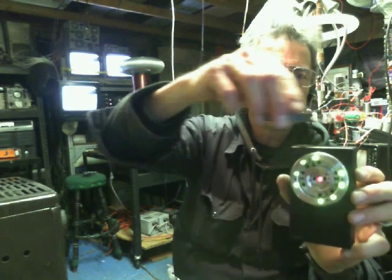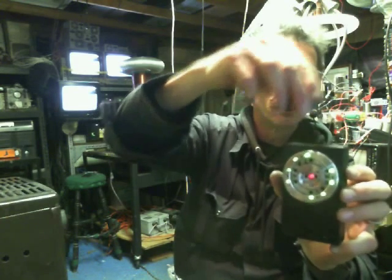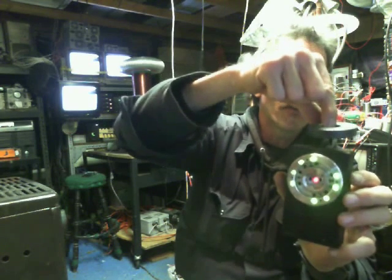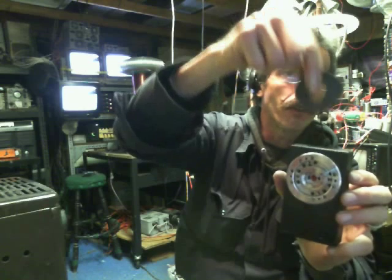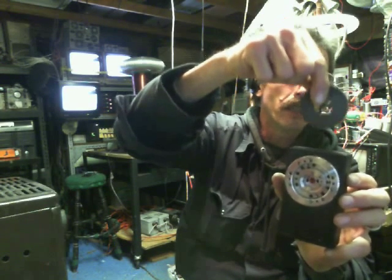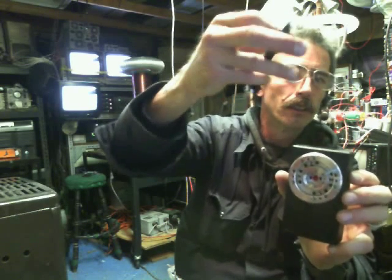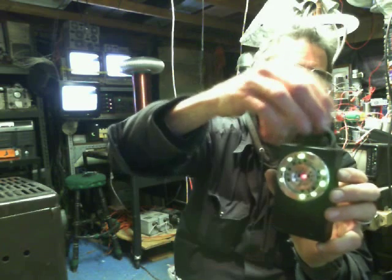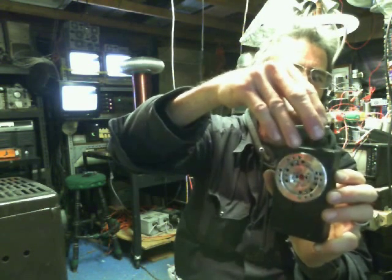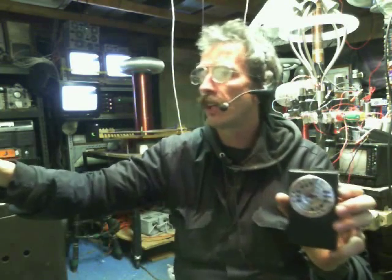When you cross the magnetic field there, you can see how far away this magnet is before it actually goes — that's how far your field actually extends. Notice that on the side of your magnet the field is not as strong; you've got to get closer. These are some things you can take into consideration when you're building your generator so that you know exactly how far away from your coils you actually have to be.